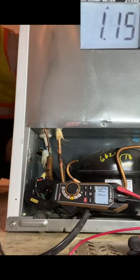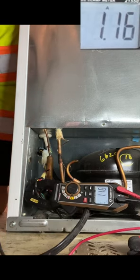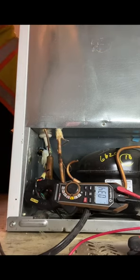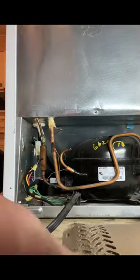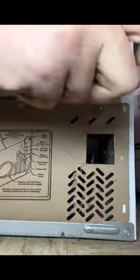Looks like 17.3 amps on start, and then 1.1 on run. Gonna let the pressure settle out, try it again, and this time we only get about 16 for peak starting current. Not finding any issues, we're gonna reinstall the back panel, and then go online and fill out the notes